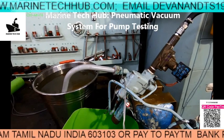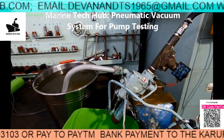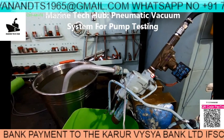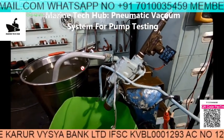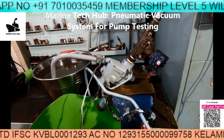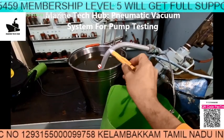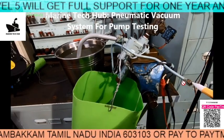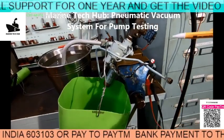Once the piston is pushed up, the water will be here. This is the pressure switch — a pressure switch which will activate and stop the solenoid. So the priming is done. This is the vacuum system. I will just run the thing to show you so that you will understand better. I kept a bucket of water here. This is the solenoid I am telling — air is coming through this. And you can see water is filled up — the vacuum will create.